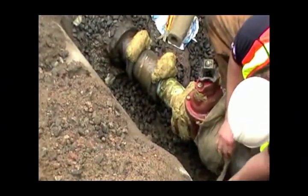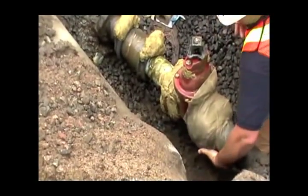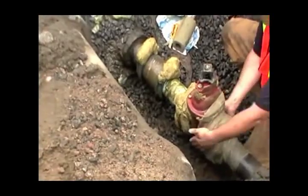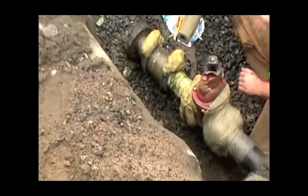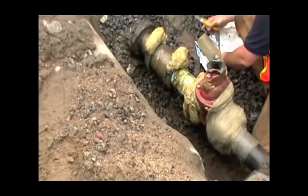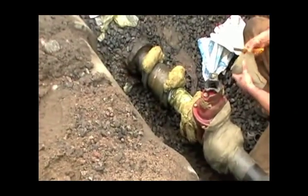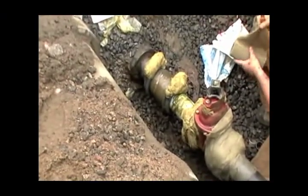Are you wrapping the whole valve there? I will. One of the jobs that we've been looking at, yes, we expect epoxy coated fittings, valves, stuff like that. So we suggested that all that needs to be protected is the part that's at greatest risk. That area that's not epoxy coated or otherwise protected, being the bolts and the gland, restraining gland, and stuff like that.